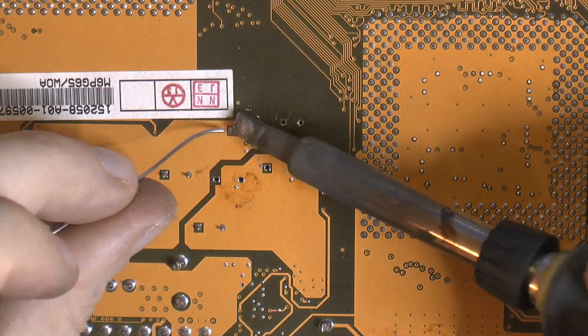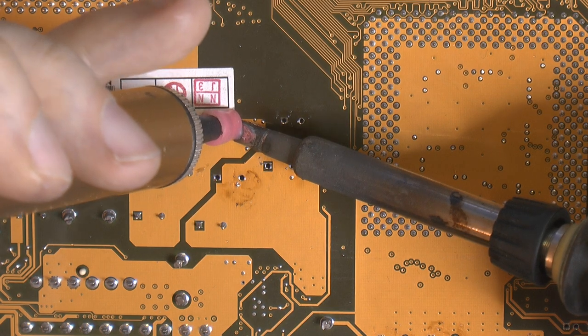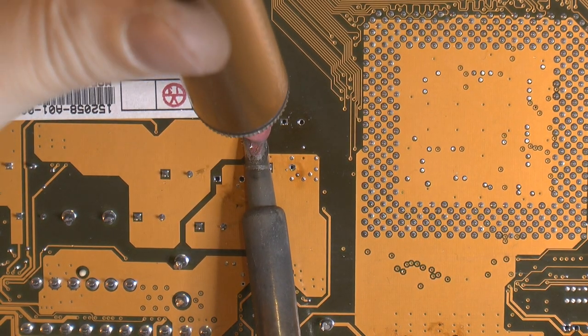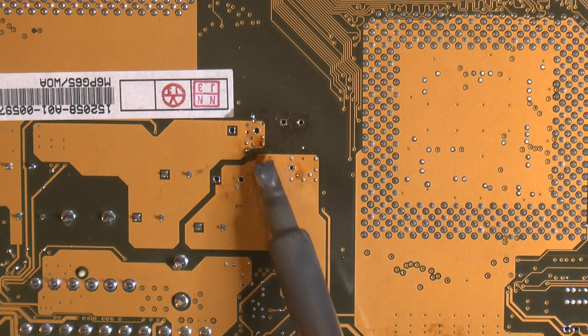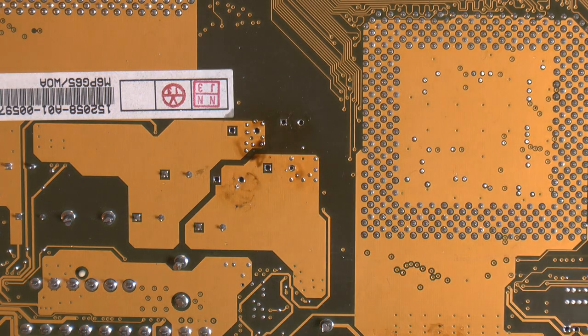So we have one more of these places with a lot of copper planes and vias here. I'm starting on the left here, because if I start from the right, I'm probably just gonna clog my hole up again. So work from left to right. Let's see here if we can get this one. Went nicer than I figured. Just put some tin back on these wires. Actually seems to have holes. One got cleaned out, but yeah, that should do it. Put some tin back in those. They tend to get removed, some of the tin, when you do the actual hole for the capacitor.